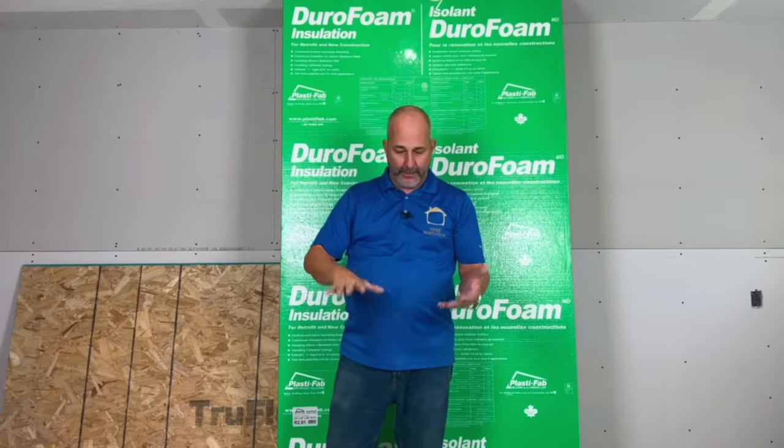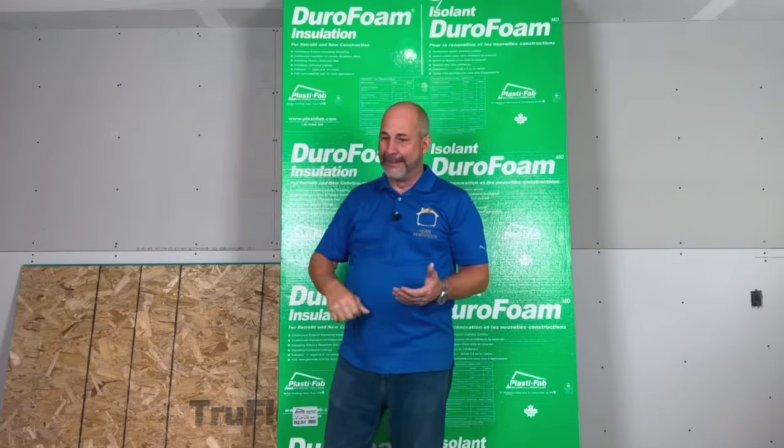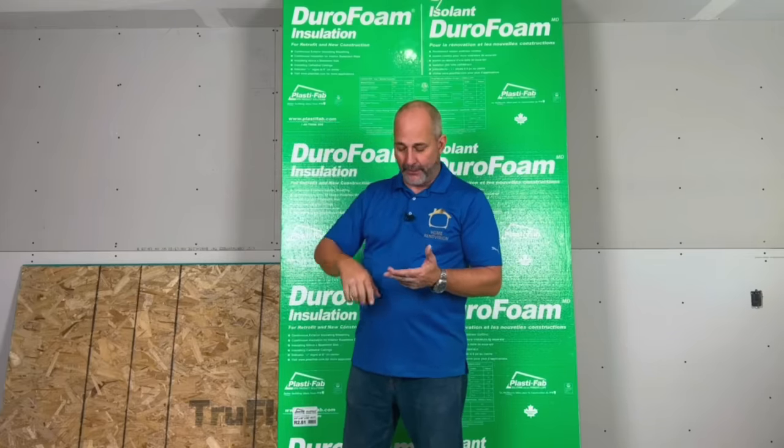If you're dealing with water management from vapor, that's one thing. If water is coming from a wall, it's another. There is no subfloor out there to protect your basement from flooding — forget that. We're dealing with managing potential risk, not flooding. We can get a thermal break, which makes it comfortable to sit in your basement, and we can have water management if we have an older house.